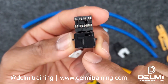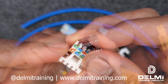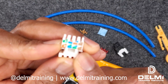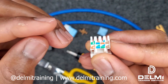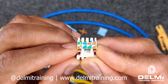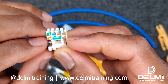On the front part with the connections facing you, you can see all the even numbers are located there and all the odd numbers are located inside. Also on the cable loading mechanism you can terminate this jack in the 568A and 568B configuration. If you're doing the 568A configuration you're going to be using white green, green, white orange, blue, white blue, orange, and white brown, brown. If you chose to do a B pinout, your color combination starting from pin number one to pin number eight would be white orange, orange, white green, blue, white blue, green, and white brown, brown.